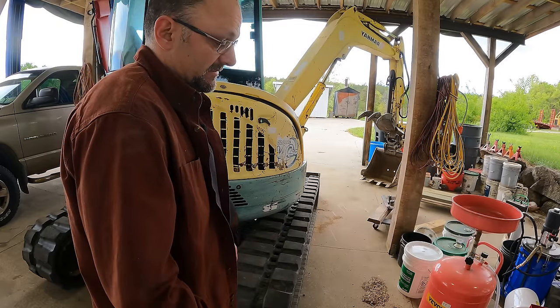So what I think is happening, when I push this forward, it's opening to the travel motor, but there's a pathway through my bypass to this idle to then return to tank. All the flow is just going through this control valve in the idle circuit and back to the tank, and nothing happens. That's exactly right. When the lever is in the neutral position, there's a pathway through the valve for oil to get back to tank. And that's what it's doing rather than going to the travel motor. Man, this is disappointing. I'm starting to think that this thing isn't fixable without installing new components, that it just doesn't make sense to do.